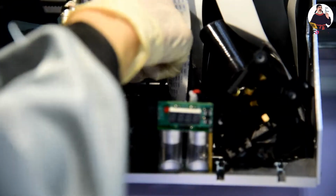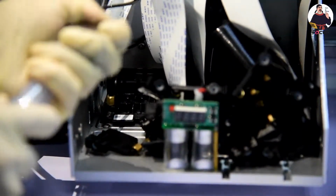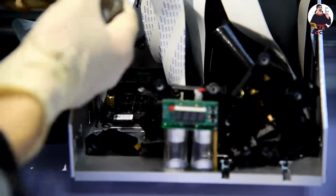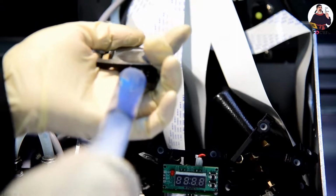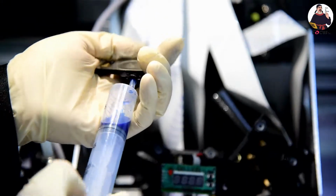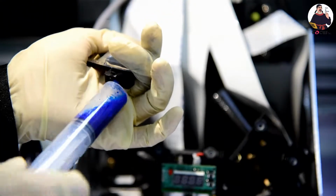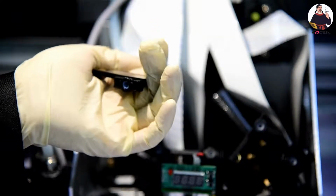The next one is cyan. We find the cyan damper, which also has a mark on the tube. Do it the same way, and be sure it is fastened at the ring. Loading: automatic stop, about 5 mm. Then we release, to be sure there is no air inside the damper and ink tube.